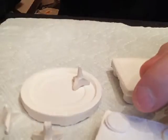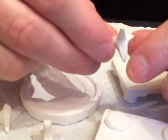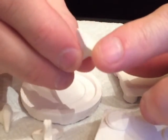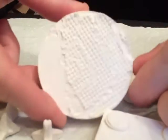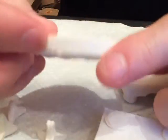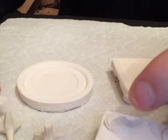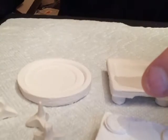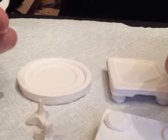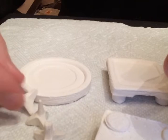The small parts here look very good. I don't see any slumping. Still very sharp, there's no tearing in them. Same with the tray here — worked out very well, still the same white color as it was before. So there you have it: workable, high-heat ceramic material, castable, that you can use to produce small parts if you're looking for a high-temperature castable ceramic material.